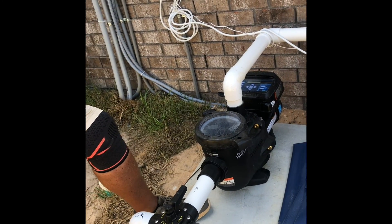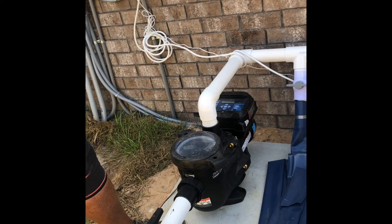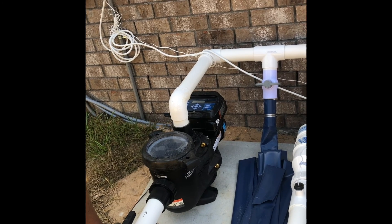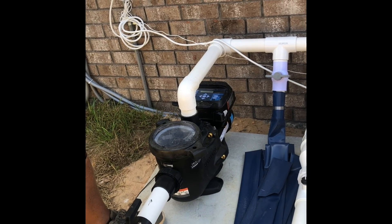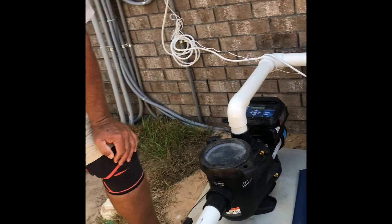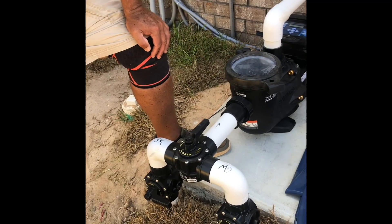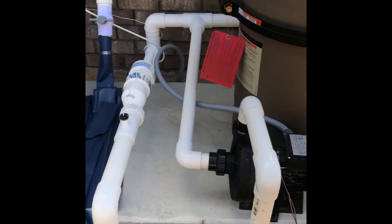This right here is your waste hose. If you get a gully washer — if we ever see rain again — and it fills up your pool, that little overflow is there to get it to the level. But remember back six months ago, we had about three or four days in a row where it just poured all the time. Your overflow is not going to catch up with it. The good thing is you've got a fiberglass pool — it's not like it's a liner. So keep your pump running, pull that hose out — it stretches all the way over to your fence — and open that valve until it goes down. But put it in the dirt because the water you're pumping out has chemicals, and if you pump it straight in your grass it'll kill it.